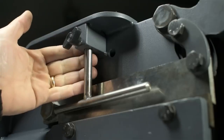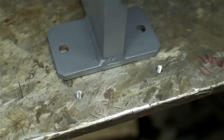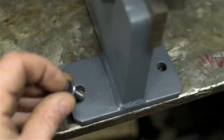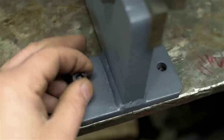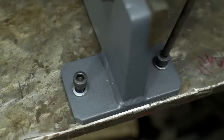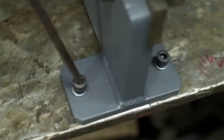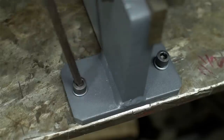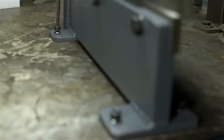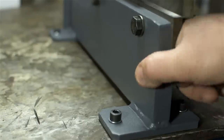We'll see this in action shortly, but first let me clear off some bench space and find a place to mount this thing. I've drilled and tapped my bench. Again, these are bench mount shears, and although it probably need not strictly be a bench, you do need to put them on something heavy and solid. I guess it depends on what you cut. Thin copper is probably a different story than eighth inch mild steel. But generally speaking, rock solid mounting makes for better times. Four rusty nails hammered over into an old log probably won't do it, unless that log still has roots and is still planted in the ground.